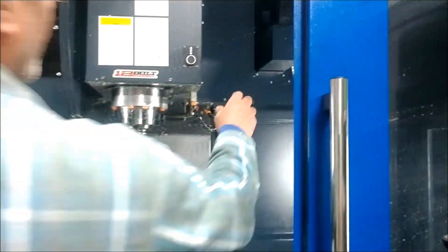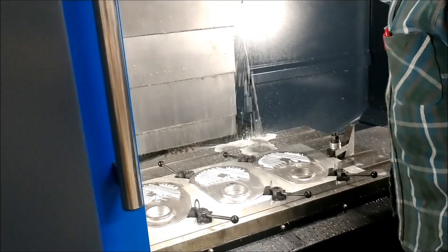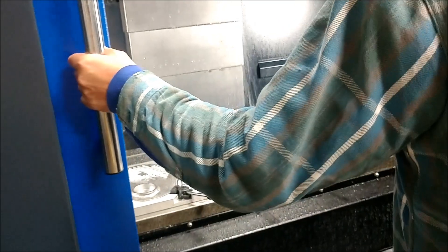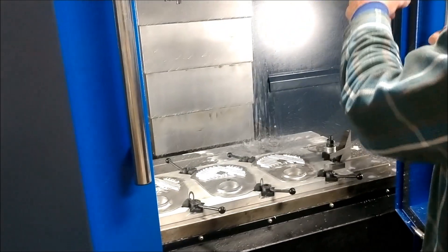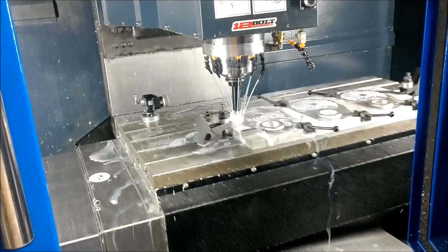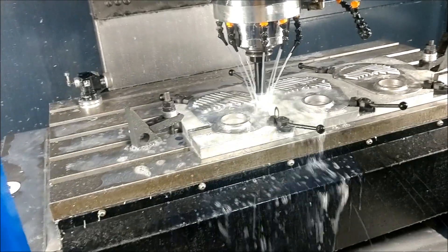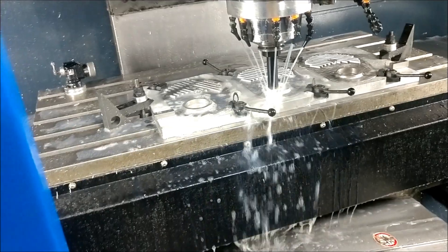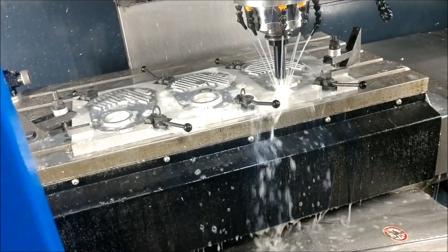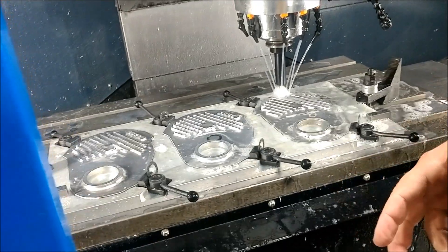So now I'm going to turn the water all the way down a little bit to cool it, so we're not going to get sprayed by it. You've got to have something to cool, just not so much to be sprayed by it. Alright, let me start it. So the first thing it's going to do is spot drill all the bolt holes. You can see the speed and accuracy of the machine. This is a really nice machine for doing aluminum work.